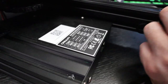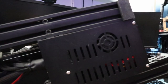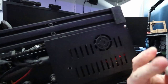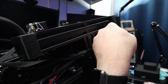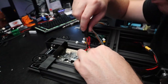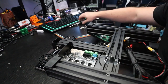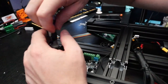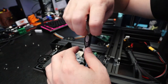To remove the cover, unscrew the top screw above your controller board and then flip over the 3D printer. Take out the remaining three screws. Once that's done, take a picture for your own personal record — a backup in case something goes wrong — so you always know where everything was connected. Now with all wires and connectors removed, take out the four screws to remove the board from the bracket.